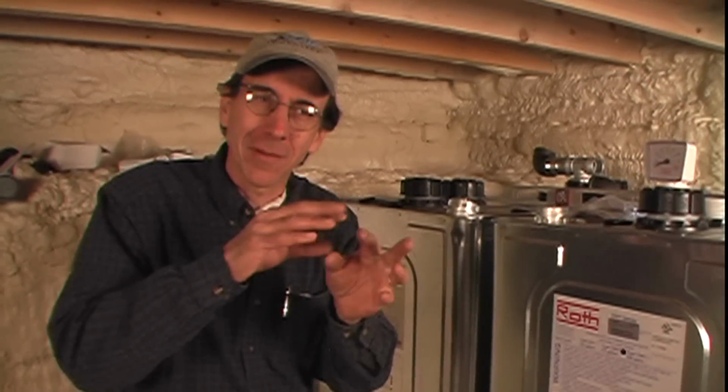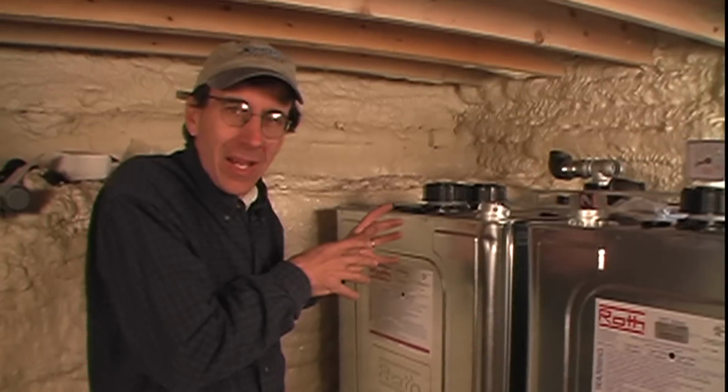Now you remember I was talking about the rust and the corrosion and all the critters, the bacteria that are eating and making sludge? Well, they're weakening these tanks if they were steel tanks. And that first steel tank is under pressure. And what's going to happen? At some point it's going to start to ooze, and then it's going to start to leak, and God willing, you'll be around when it happens, or you'll spot it. Excuse me, I'm choking. It's such an exciting thing. And you'll catch it before there's a big spill. But it happens. These things spill oil in basements. Cleanup is a bear. If you ever smelled fuel oil, it isn't pleasant.